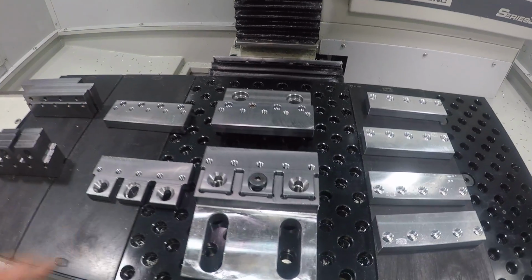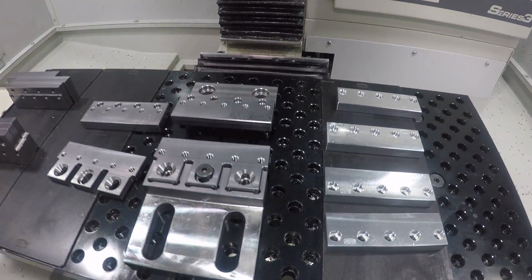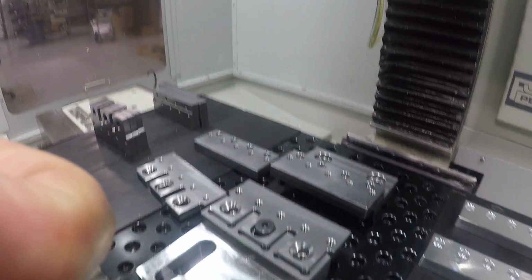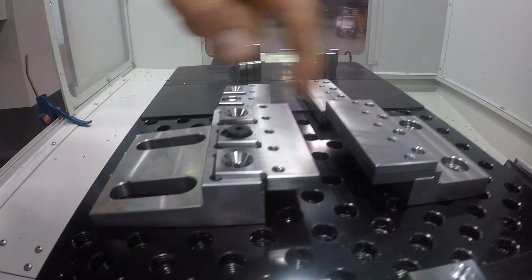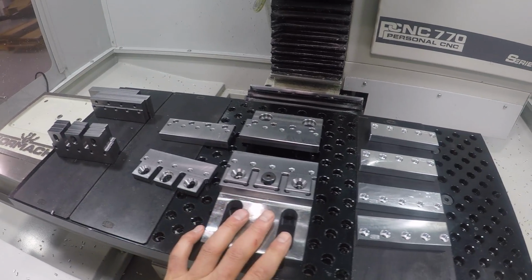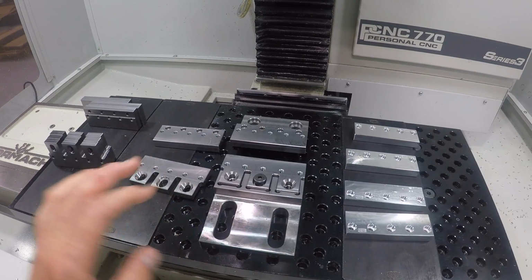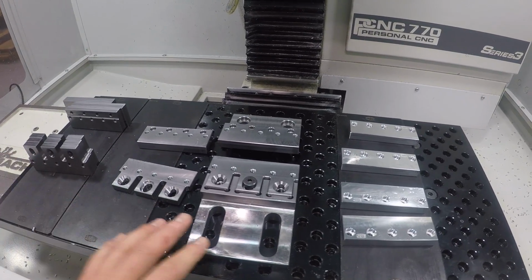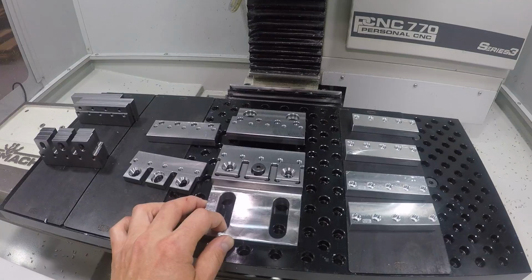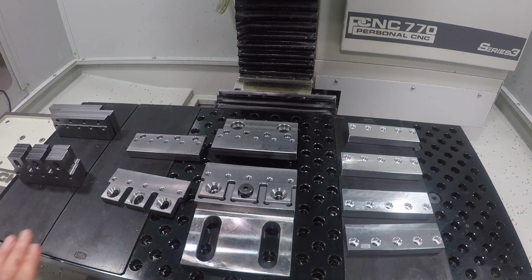And so we've done some testing. We're obviously still testing, but in our testing, the biggest question or concern was the fact that these are cantilevered out in the air, and we're not seeing a degradation or at least a meaningful impact on that in terms of the rigidity and the security and the repeatability under the greatest clamping pressure that we could apply. Wailing on it, we were able to measure about 2 thou deflection or lift, and that's okay.